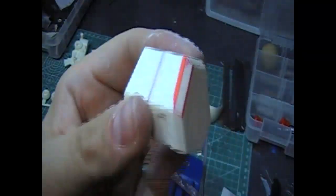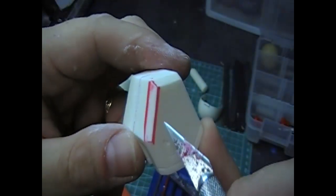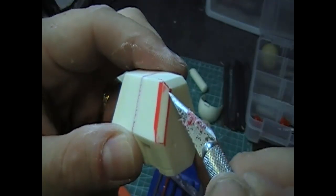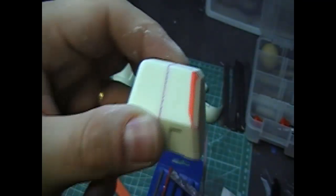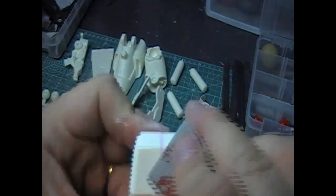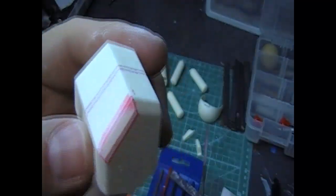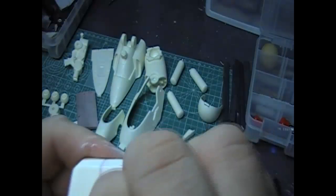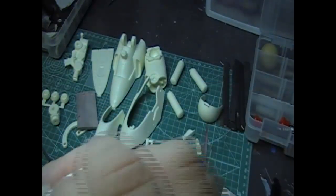So when you're done with that process, what you end up with is a nice square bevel, and you will see where the edge is all the way around. So when you're done, you'll have a nice flat bevel just like that. I didn't necessarily need to do that for this piece, but I wanted to show you because a lot of times I get a little overzealous with sanding, and sometimes the pore marks, like in the warp, will be right on the bevel, and by the time you're done filing and sanding it, that bevel is all but gone.